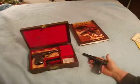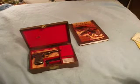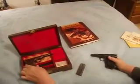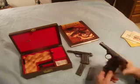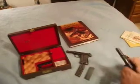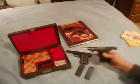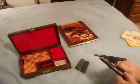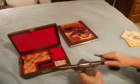The Savage is called a delayed blowback because most pistols of this period had a blowback action. And this one, let me get rid of the magazine here. This one sticks, as I recall. By the way, Savage changed the magazine release. This one, you push right here to release the magazine. The later ones, you push here to release the magazine. These do interchange, by the way. Let's see, take the safety off, then pull to the rear, right. Thusly. And the way this works is this cocking piece, let me do it on this one because the springs on this are a lot easier to deal with.